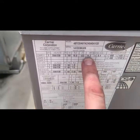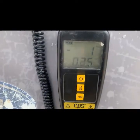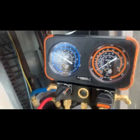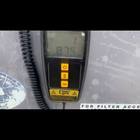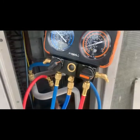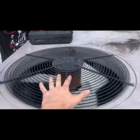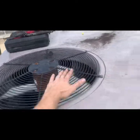We'll weigh in 14.2 pounds — ouch. The process begins. We're slowly bleeding in: 14.3, 14.7, 14.2. We're going to get it to take what it can take and then we'll fire up the unit and have it draw in the rest. Boom — she's running good.